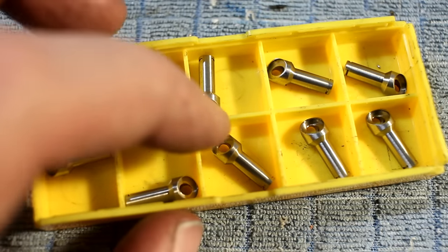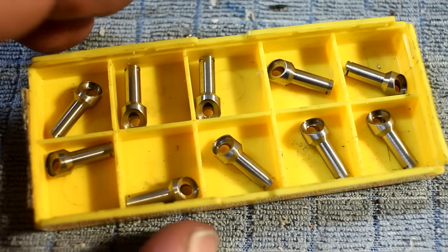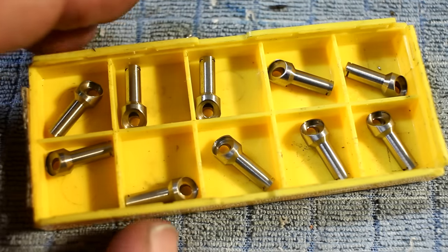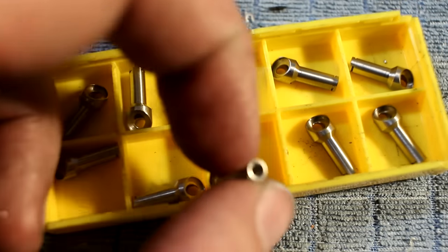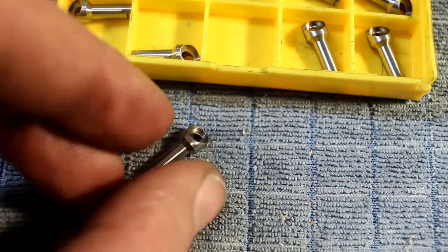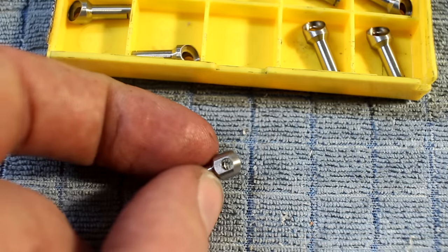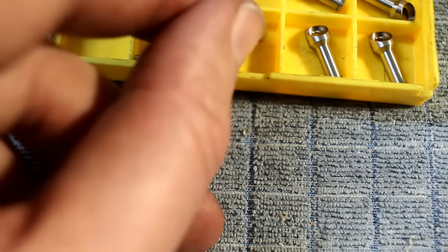So they are machined out of 14305 stainless. That's the ISO designation. The ANSI designation for the steel is 303 stainless. So they're fairly complicated. OD, ID turning, some boring at an angle, some square boring, and some rotary table action.